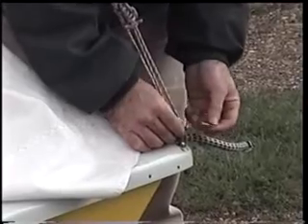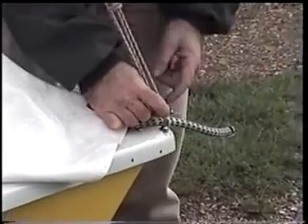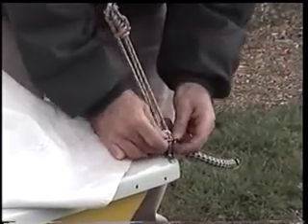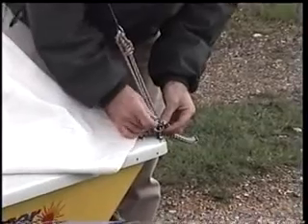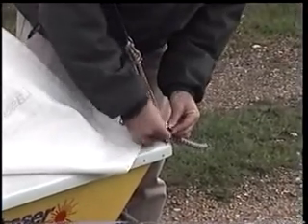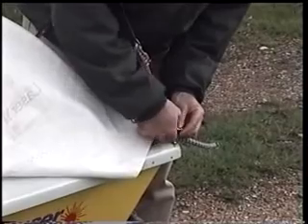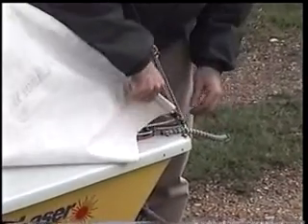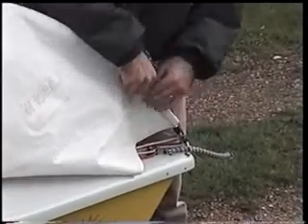You really don't ever want the pin to be that way round in your shackle, because it will just go straight through the spinnaker and cause a fairly expensive repair. So turn it round so the pin goes in from the other side, then tighten it off. If you've still got little sharp bits, put a bit of tape on it — you can see I've put tape on there to stop the spinnaker getting caught, giving you a nice flush edge.